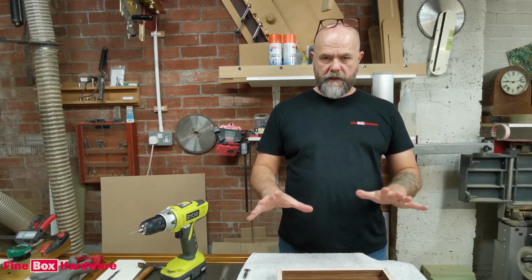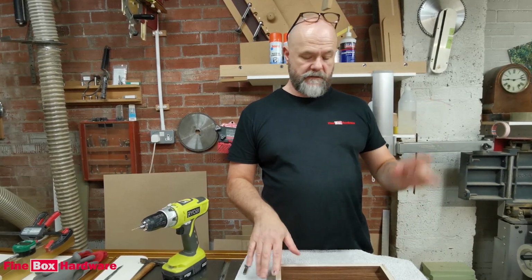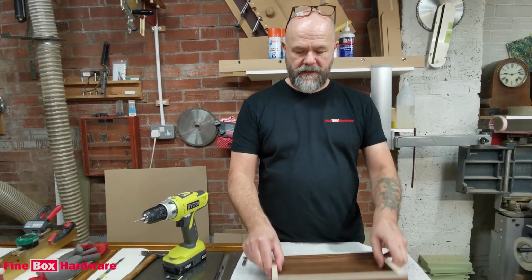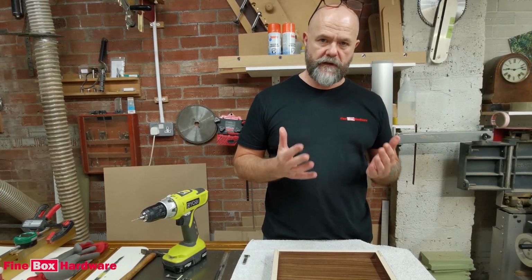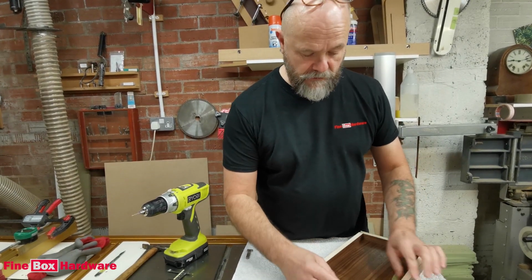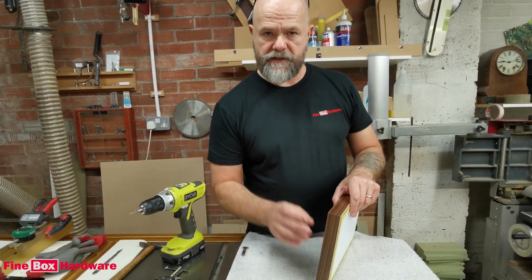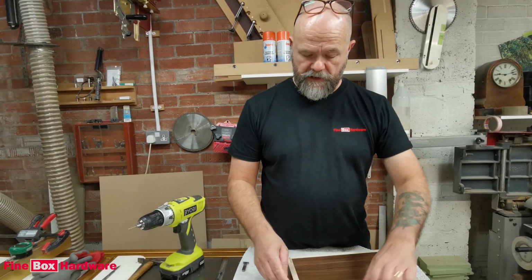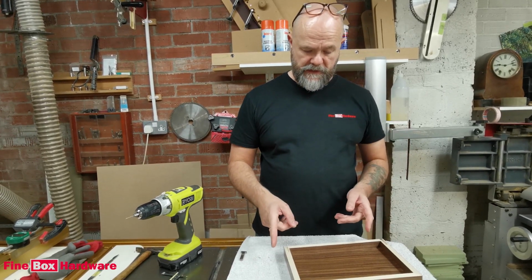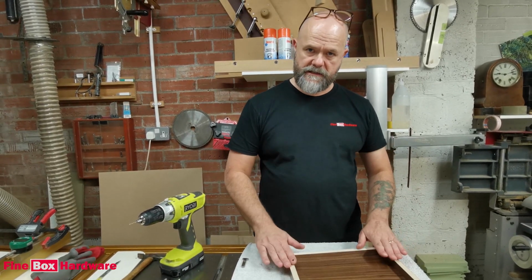You've got them done. Next week, we're going to add some coating around these edges. We're going to add a wee micro bevel. Some people like quite a sharp fit there, but I prefer a wee bevel. I usually don't put on a heavy bevel, but on this I'm going to put a slightly larger one because there's a bit of sycamore underneath and I want the separation to show a wee bit of sycamore. So I'm going to cut the bevels next week on the router table with our diamond bit, and then add just a wee light sealer and then some wax.